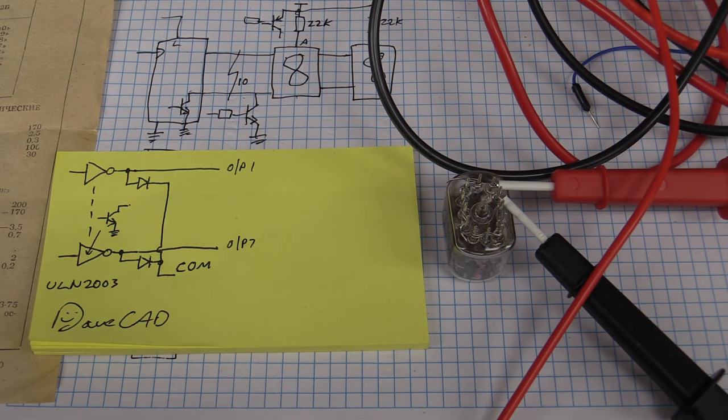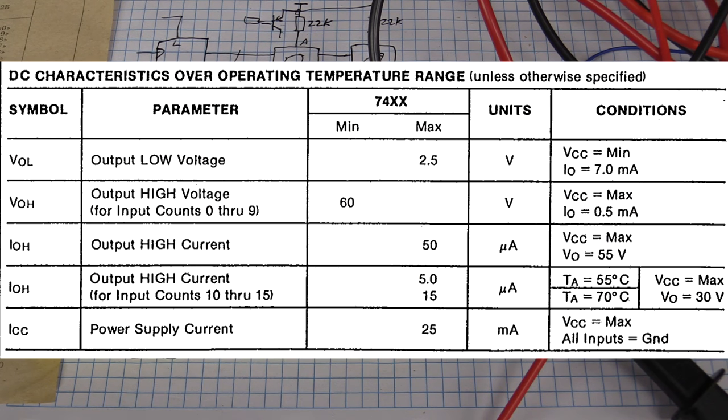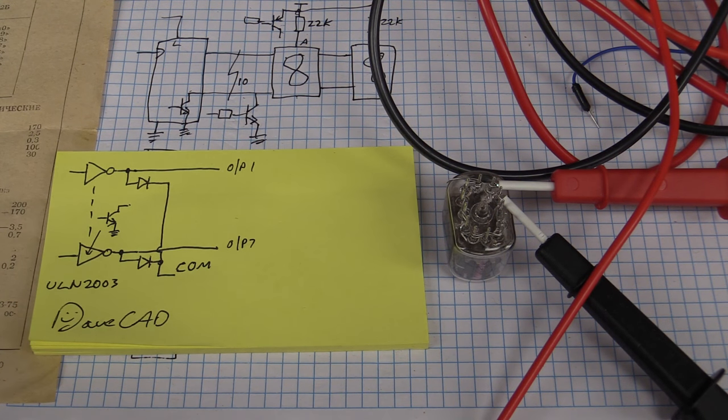But as a few people pointed out, the classic 74141 driver chip, which is now obsolete, although yes, some people have pointed out that some company in Russia still manufactures it or something like that, I don't necessarily want to use that. I want to use a more modern, readily available solution. Anyway, they point out that that 74141 actually has a fairly lowish voltage rating on those open collector output driver transistors in there, and fair enough. It's, you know, 50, 60, 70 volts, something like that.